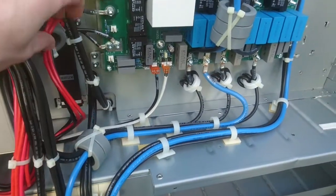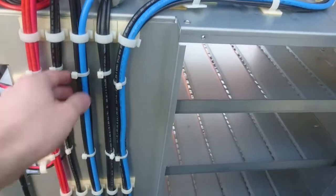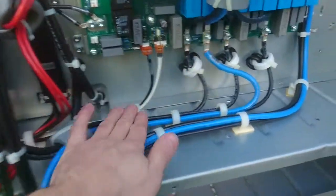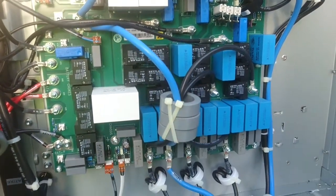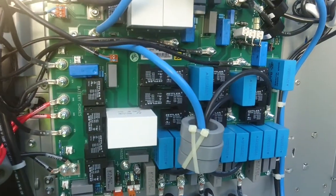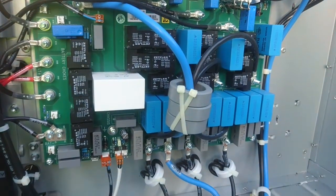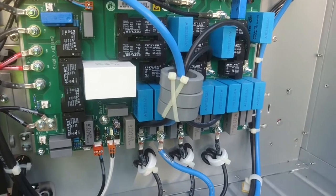The input for the battery is these four terminals. The mains input power line runs up through the mains breaker at the front. It goes over and connects to the input terminals, has a lot of very heavy filtering, large chokes, and about three to five relays in parallel to handle the current. This UPS can also be used in a bypass mode where it bypasses the battery bank and mains power just runs through it to the output.